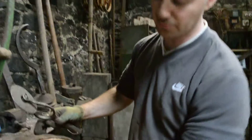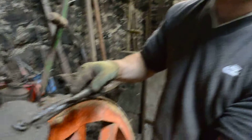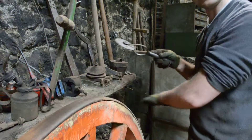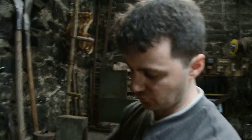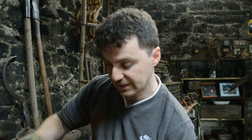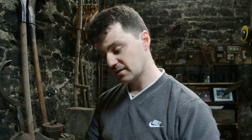When the farmer would bring the wheel to the blacksmith, the iron band might be going out of it. So the first thing was to calculate the circumference - maybe 20 revolutions or whatever. That would tell you the length of steel bar you'd need. They would cut the steel just slightly short of the circumference of the wheel. When the band was made, there was a big fire outside the forge and they'd put the band into it - it would expand slightly so it would just go over the edge of the wheel. Then buckets of water were thrown on, so it would contract, and because it was slightly smaller than the wheel circumference, it would tighten everything together.